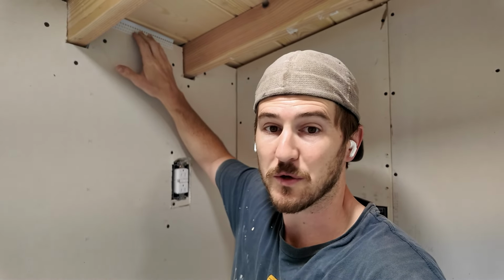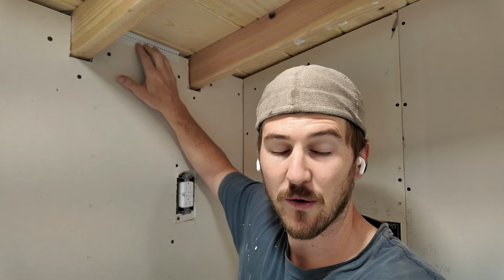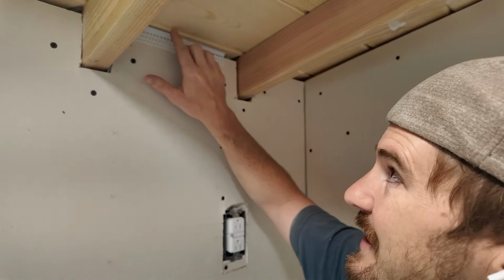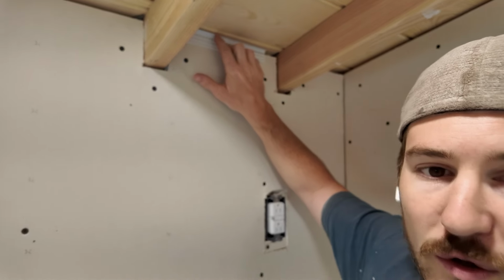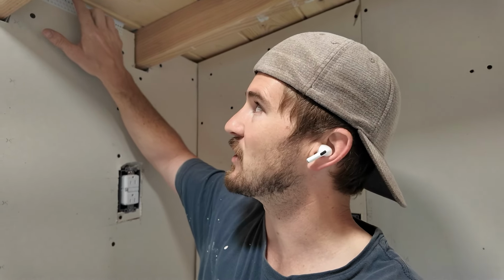Then you can wait till you paint. So you've gone through sticking it on, your coats of drywall and sanding and painting, and then there's a little tiny tab up here that you can peel away, and it gives you this really nice clean edge, all while protecting the surface that you are going into, and then it just gives you a nice clean joint.